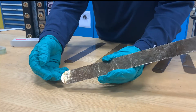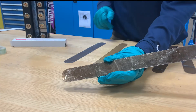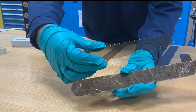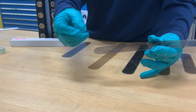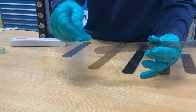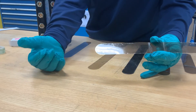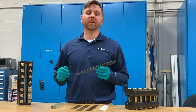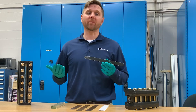This is an example of a low quality piece of mica. Obviously this is an extreme example because you can barely see through it. When you compare that to a Jurgeson piece of mica, you can see that it's very different. A good piece of mica is not going to have air inclusion bubbles, delamination, surface cracks, hairline fractures, or things of that nature. A quick visual inspection should give you a pretty good idea of whether or not the mica is high quality. Defects in the mica can significantly affect its ability to protect the glass — in other words, quality matters.